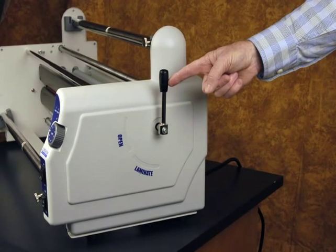The operation lever, which is normally found on professional laminators, has two positions. When the lever's black knob is pointing straight up, the laminator is in the open position. This refers to the heat shoes and pressure rollers being parted or opened. This open position is recommended for longer periods of non-use time, thus avoiding the possibility of flat spots being developed on the rollers.